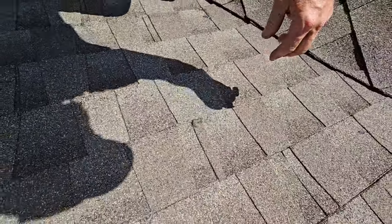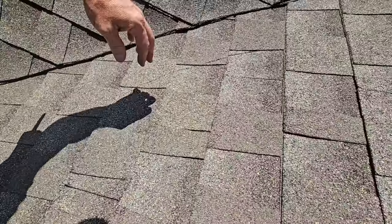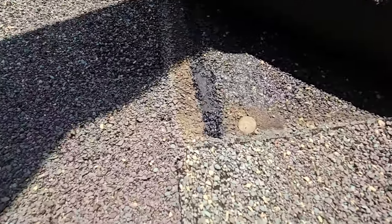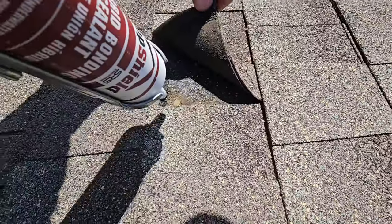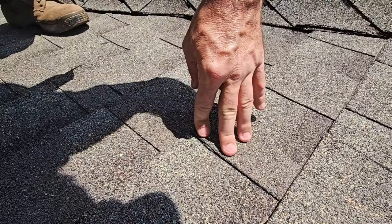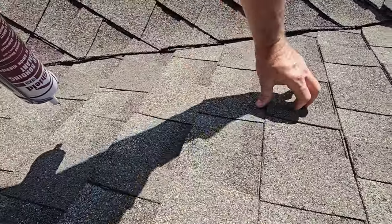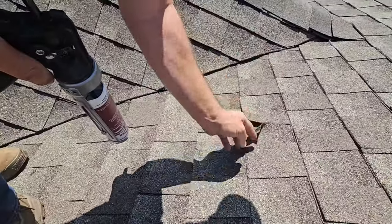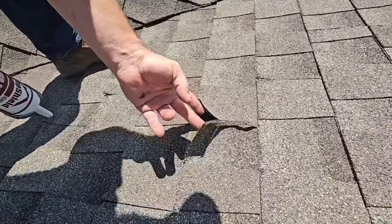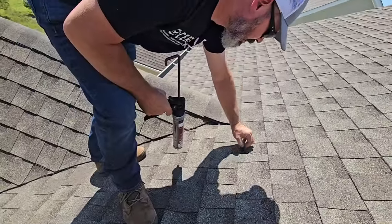Problems happen right under these seams. See that nail on the seam? The water's going to run right into that — it's starting to rust. So we're going to temporarily put some sealant on here and squish that stuff in. I think what we'll end up doing, because this roof is so bad, is giving a quote to replace it entirely so they don't have to deal with this headache in the future and end up with their ceiling leaking everywhere.